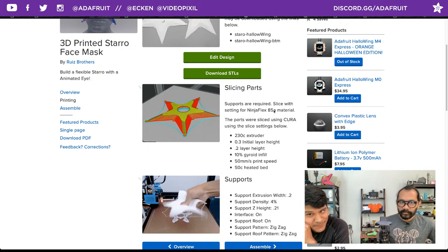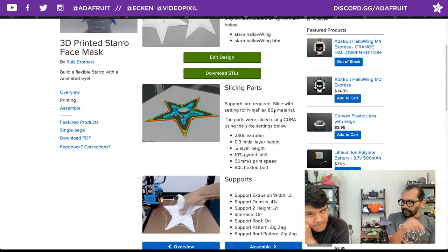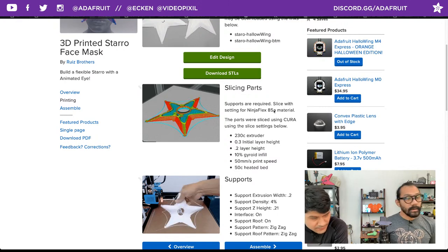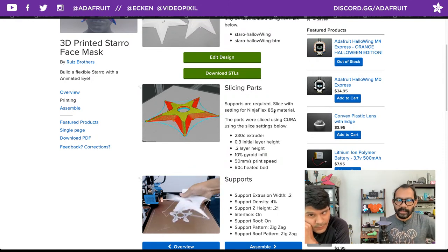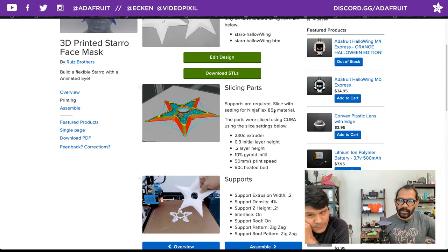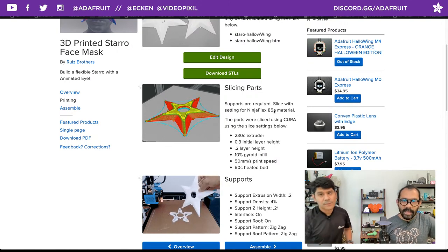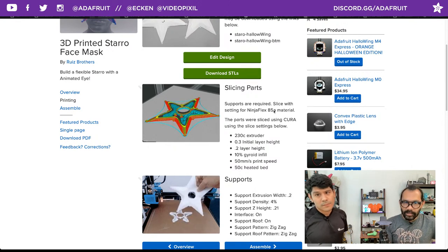Okay. And because I think it's a little heavier than the PLA, it does tend to stick down too. Now, there isn't any glue stick, any hairspray, none of that stuff you used. It just adheres to PEI very well. Okay. And it's a textured bed as well, right? Yeah. And then standard layer height, 0.2. You can go at 0.25, but I just wanted these curves to be nice and not have so many steps in the layers. So use the 0.2 layer height for that.